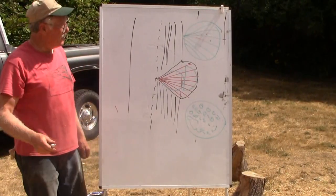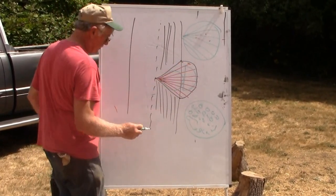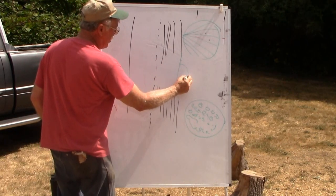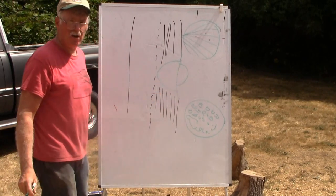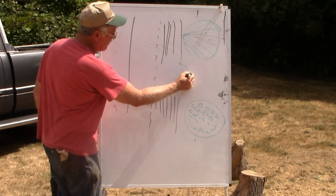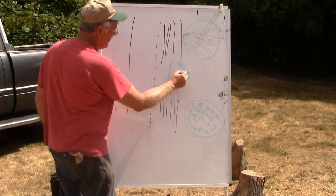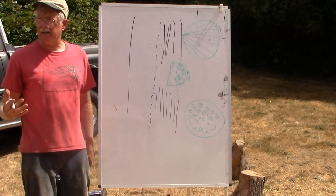And Roger's question was about the two I turned Thursday. They were cap burls. So sometimes you just get a small burl on the outside, right? If you take your bowl and you cut your bowl out this way, you turn all the burl out. So what I did in this case was I made this the bottom of my bowl, and I came up here a ways and like this, because this is all burl, right? The bottom of the bowl is all burl. Up here, it's a little bit straight grain, but it's up on the wall. They really don't see that.